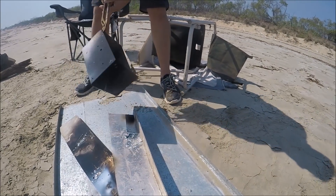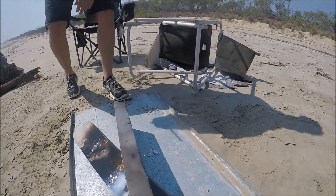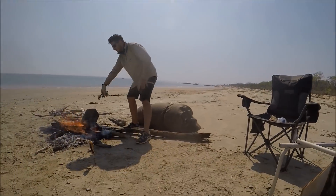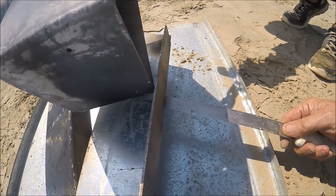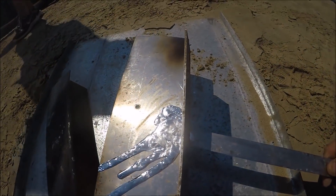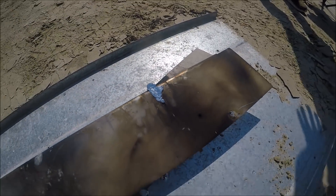But you can top it up like that. Too hot - not much of a difference though, is it? Coming through, going out. Definitely - look at all that. Last trial. This time we've pre-heated the metal. Oh, that looked good - big corn. Yeah, that looked pretty good I reckon. Turn it over and see what we've got. Yeah, that's what we're looking for - penetration all the way through.